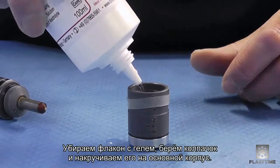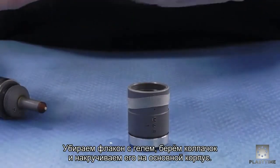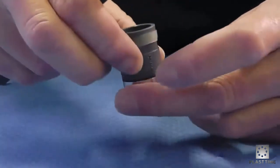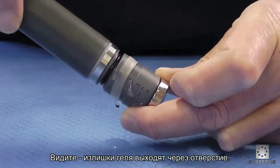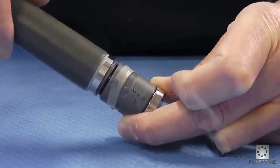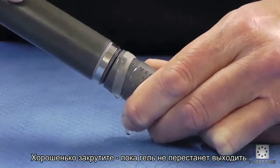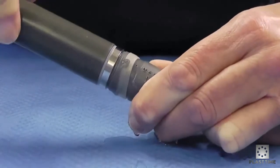Once the cap is filled with the gel, we store the gel on its lid. We then get the membrane cap and the probe with the hole exposed and we screw them together. You can see there's excess gel coming out from the weep hole in the side as it's supposed to, and you screw the cap on until it's firmly screwed right past the rubber seal until it's completely closed together.